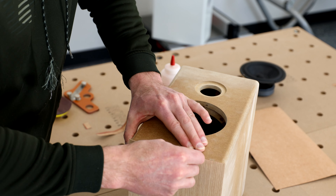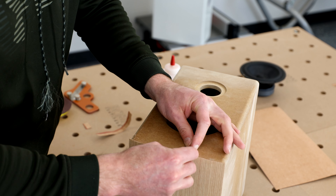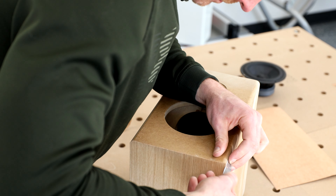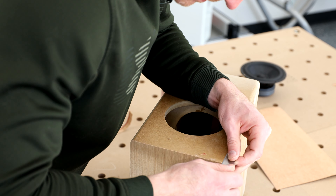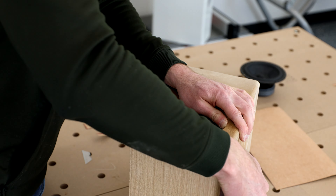If you're going this route, cleaning things up by hand, expect to spend some time with a sharp razor getting the veneer close to flush. When I say close, I don't really expect you to get the final look with the razor. Instead, we're going to be using a sanding block to get it perfectly flush and to smooth any inconsistencies in your razor cleanup.